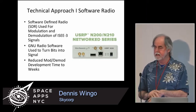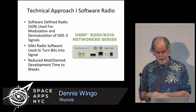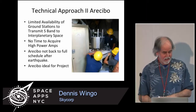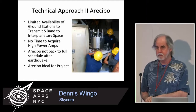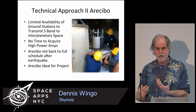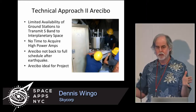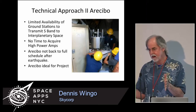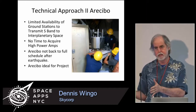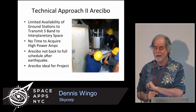I thought, there's this really big antenna in Puerto Rico called Arecibo. Maybe we can use that. Here we are a few weeks later at Arecibo. One of the problems forcing us there is that I can't just order off the shelf a 10-kilowatt 2.4 gigahertz radio transmitter — I can, but it's going to take six months to get, and we didn't have six months. So we substituted a really big antenna and bought a really small transmitter.